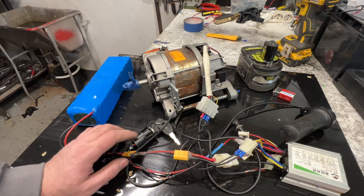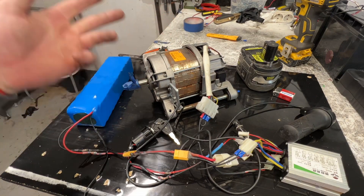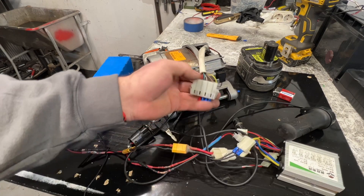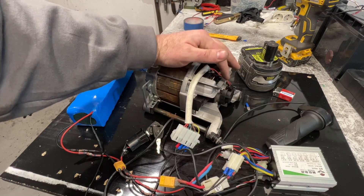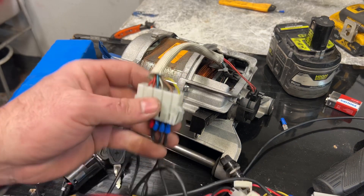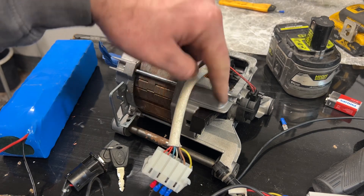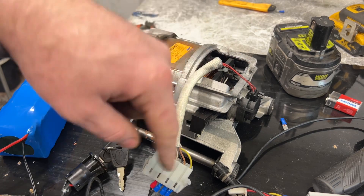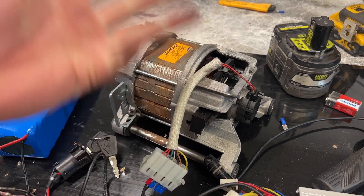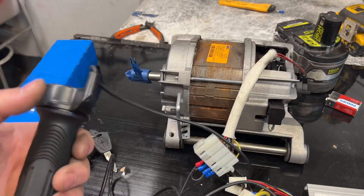So this is how you convert your 220 volt washing machine motor to 12, 18, 24, or 48 volt DC — so simple. Always, these two red wires you don't need. You only have to make the connection: one brush wire with one coil wire, and one coil wire with another brush, then connect to the controller, and everything will work fine and easy.